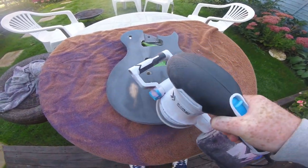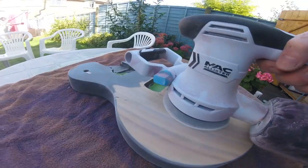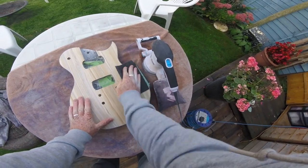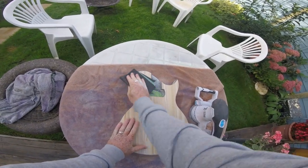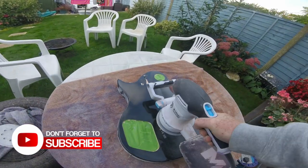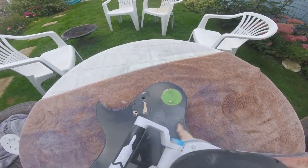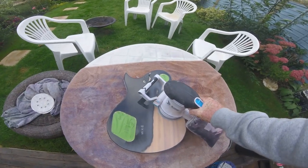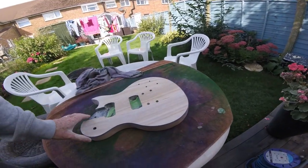It took a few hours to get through it all, but it was worth it. Got the whole black gloss off of there, and the wood underneath is surprisingly nice - I'm really digging the grain on it. Done the front and then sanded it all back, working the way up to 320 grade sandpaper, then back on the 80 grit for the back and the sides. You do have to get all of it off for this method, including the sealer, which is still yet to come off the back and sides - and that is the hardest bit to do.